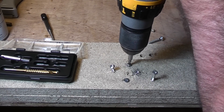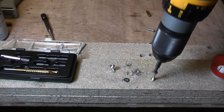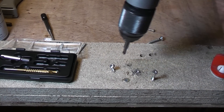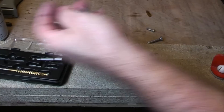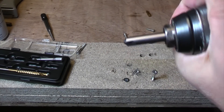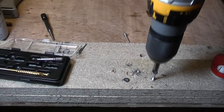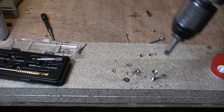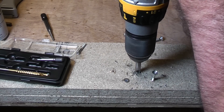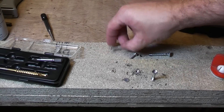And I think that's out. Let's remove that one - and that one's out. Let's try the bigger extractor now on that particular screw. So I've put the larger one in now, again I'm going to put it in reverse. And you can see there that it's just not going to remove that one - it's just taking the head off it. So we've no chance of getting that one out. I think it actually just snapped the head off that one. So it does work on some screws but not on all screws.